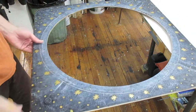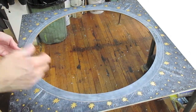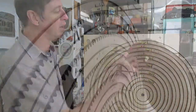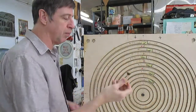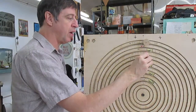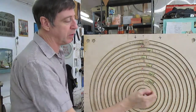I just want to show you how well this wax works. I put one of the rings in — this is the larger part of the frame — and it makes me happy. I screwed the whole thing together. It went pretty well. I only had to shim a couple of spots where things were a little bit tight. The next thing for me to do is put the gear and pulley assemblies on each one. Each of these have a little bracket that basically holds it on. The reason I didn't put a collar on each one is because all the axles would have to be much higher — I wanted to keep the piece as slim as it can be, so I went with these minimal brackets.